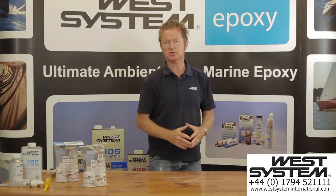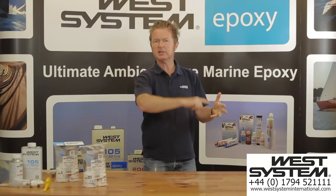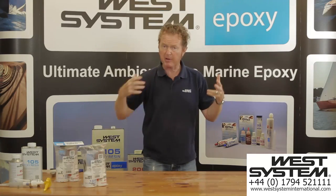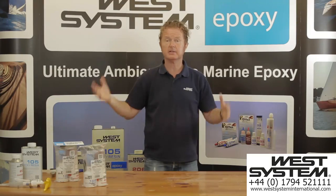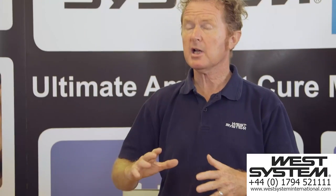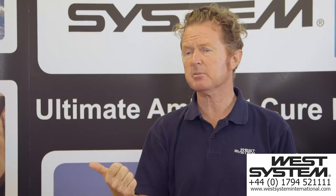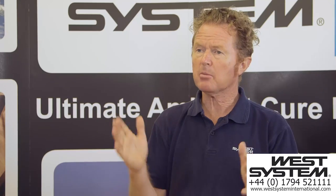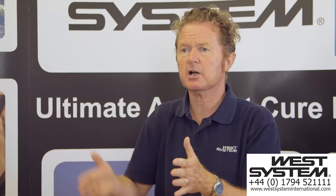Very important that you use a dry source of heat. So not propane nor diesel heating. Both of those methods create a lot of excess moisture in the environment, and they will really compromise your work. They'll create lots of amine blush, and they will compromise the bond between layers of subsequent coats of West System epoxy.